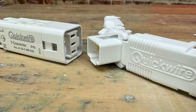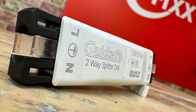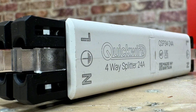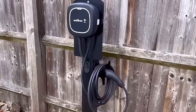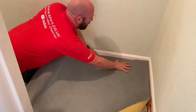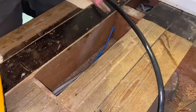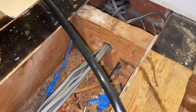And now we have the Quickwire 24 amp splitter junction box in both two-way and four-way, and I've managed to tear this out of Gary's hands so I can use it on a job I have coming up. So you join me again at the same customer's property where I fitted an electric vehicle charger - and you may remember me saying that the customer is decorating. This time the customer is after three additional sockets in the bedroom. It's a little awkward going back to the consumer unit, so I've decided to break into the ring and extend it, and also take a spur to an additional socket.